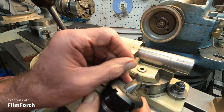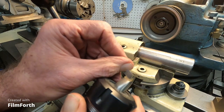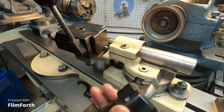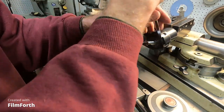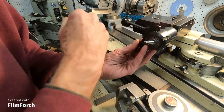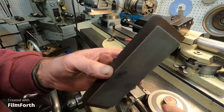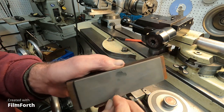I'm going to hand-put the radius in there. Shaves the thumbnail — very, very sharp. I'll put the radius in. It's very difficult to do machine radiuses, so I do it by hand. I use an easy lap, and I just got that out of the grinder. I'm going to go across the top here with it.